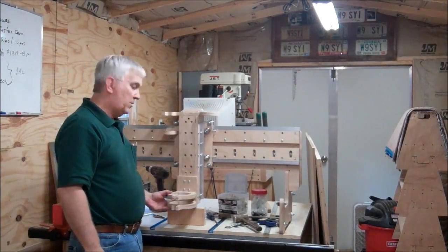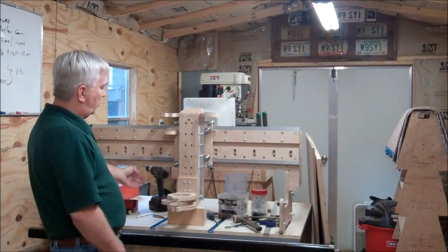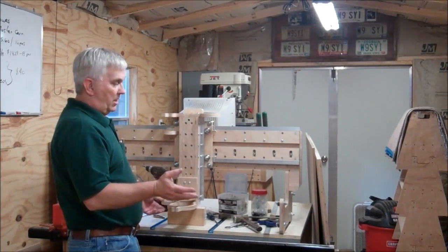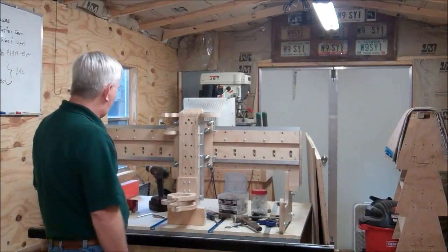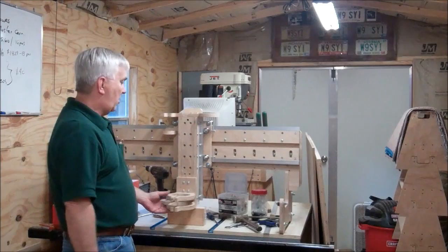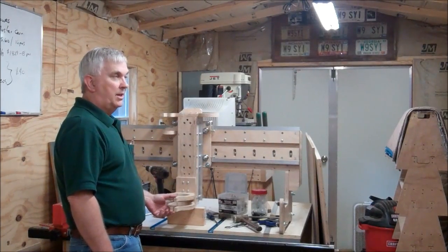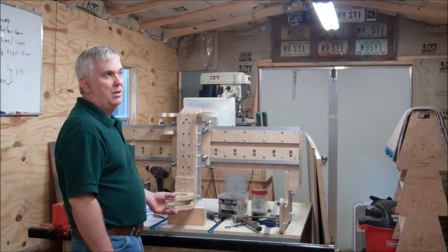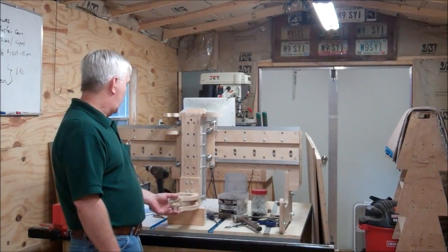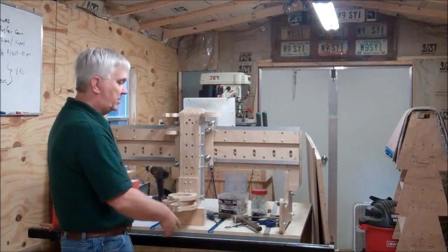I think in the first video I was talking about making this roughly the size of my other machine — about 40 inches wide by about 26 inches of cutting area. But I bought two 8-foot angles, and by the time you cut them in half you get 4 foot. So I called Jim and said I might as well make this thing 4 foot or 48 inches by 40. You lose a little because of the gantry, but we should have a cutting area of about 34 by 40 or so — a good bit bigger than what I originally started with. He was okay with that and has room for one that big in his shop.